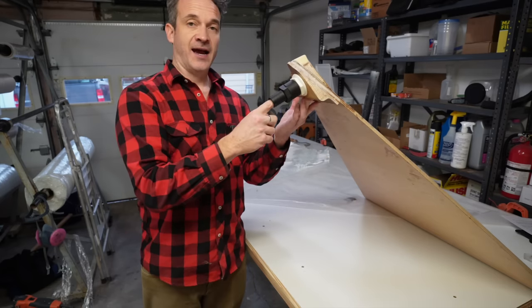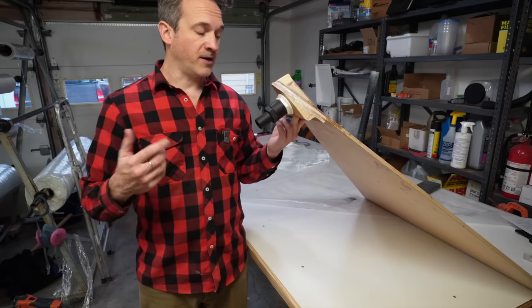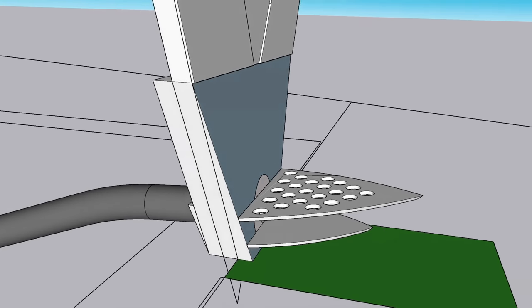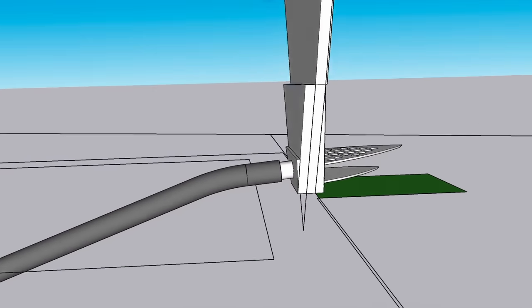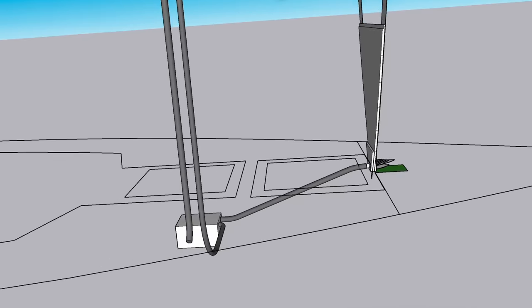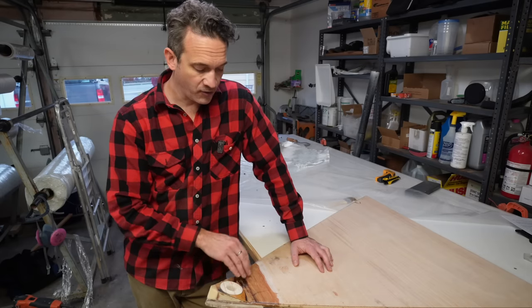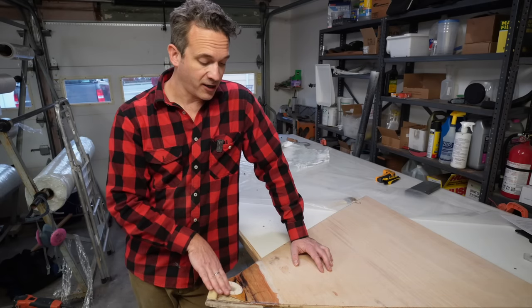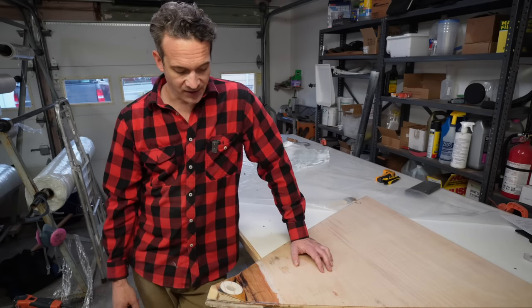So now with this hose attached, I'll be able to drain this wherever I like. I could drain that hose to the bilge, but what I actually plan on doing is running this down to some location where I'll be able to somewhat conveniently access, and I'll install a shower sump. So from there, I'll be able to maintain the pump and then pump this water out of the boat, slightly above the water line somewhere, through a high loop, maybe some sort of a high water alarm somewhere so I will know if that system is backing up. If my anchor locker is starting to flood with water, I'll know, and I can maintain that pump and get it all evacuated.